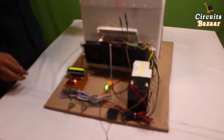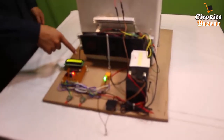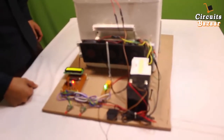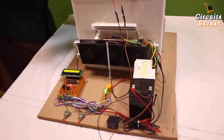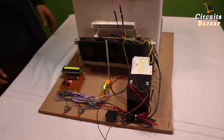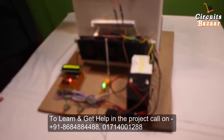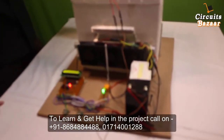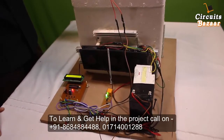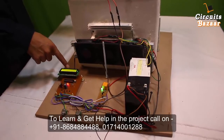Now we are going to turn on the power supply. The exhaust fan is on — the temperature right now is 25 degrees Celsius. Currently it reads 25.80 degrees Celsius inside the box. We have set the cutoff at 24 degrees. The Peltier plate takes a lot of time to decrease the temperature — now it is decreasing and becomes 25.39 degrees Celsius.